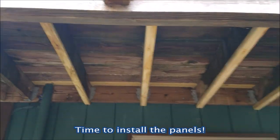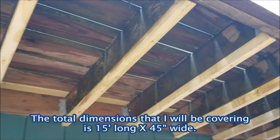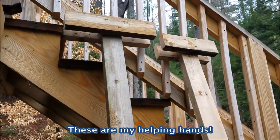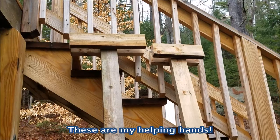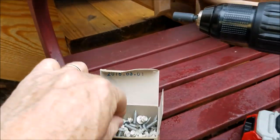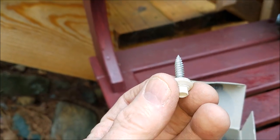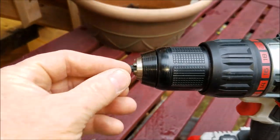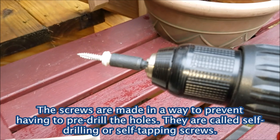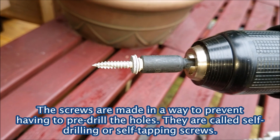Here I am on Saturday morning. I have all of the wood inserted at the various levels to create the slope going down to this end, and I have the two structures I built to hold up the other side of the panels. I have my Porter-Cable drill and my Tuftex screws with the rubber washer and metal washer, plus the magnetized hex head attachment so the screw stays in without needing pre-drilling. I'm ready to put up the panels.